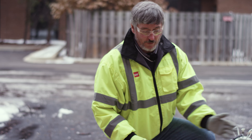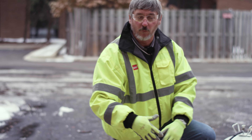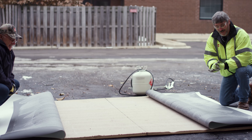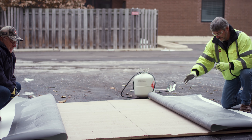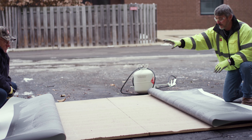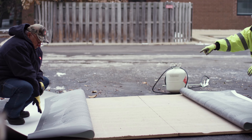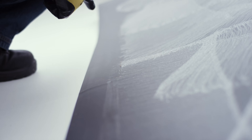We're going to roll one side in, and this side is going to lap on top of it — that's going to be our weld area. We'll broom it in and we're done. We've got the adhesive installed on the insulation and on the membrane, and it's ready to be rolled in. Now here's where you've got to pay attention: if you butterfly sheets like this, there's a certain order you have to roll them in. I'm going to roll this side in first — Dave, why do we not want to roll that side in first? Because I have the bare side over here, and that's what we're going to weld.